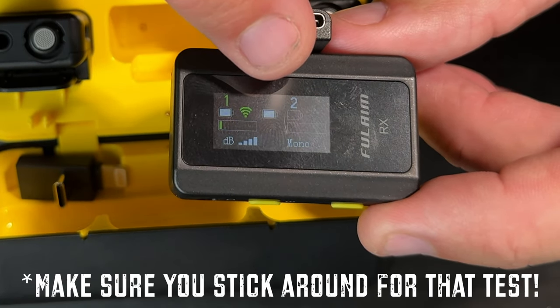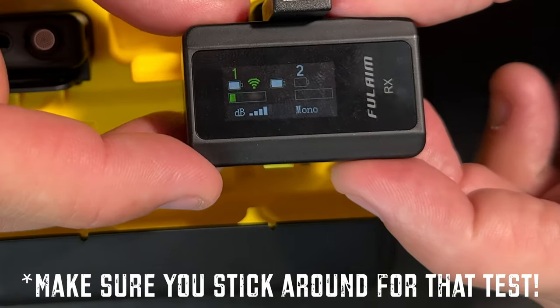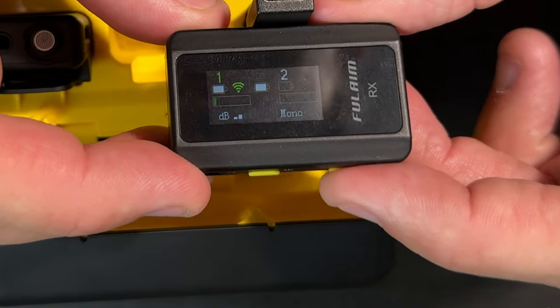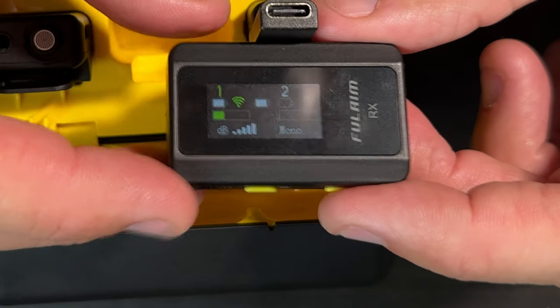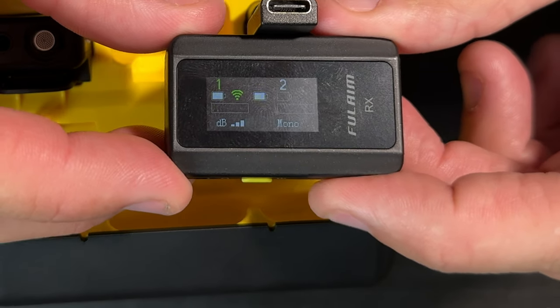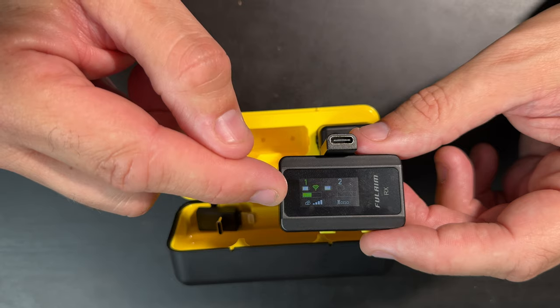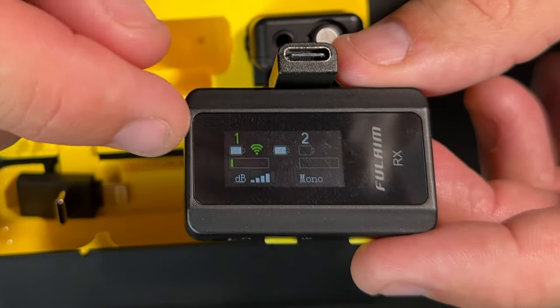Yes, that's right — 200 meters away — you should still be able to hear it clearly. You can change the volume; if I just click the set button it puts the volume up. I'd recommend having it between three and four. If it's too high, you can blow out the tops and bottoms of your audio and it distorts even if you then reduce the volume. So I'd recommend having it at maybe three if you're in close quarters. The receptivity of my voice volume shows right there and then you have the battery level.